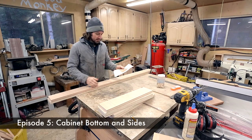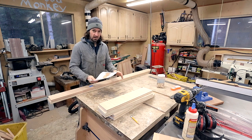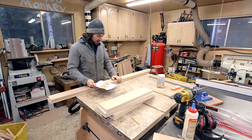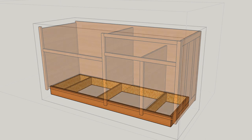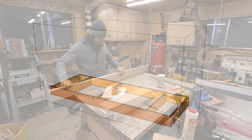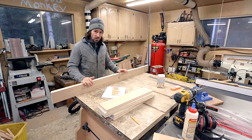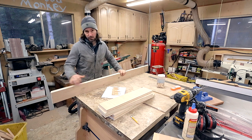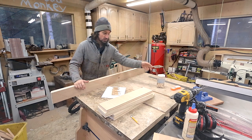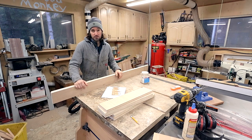The next thing I need to do is to assemble the bases that give your kick area underneath the cabinets, and I'll zoom in on the plans. I cut pieces of plywood because the plywood is a lot easier and cheaper to use than actual solid alder for me. I only have one side which is going to have a 45-degree angle. That side I'm going to do a biscuit joint, and then the rest will just be pocket holes because you won't see it.